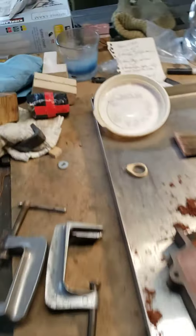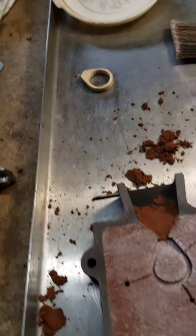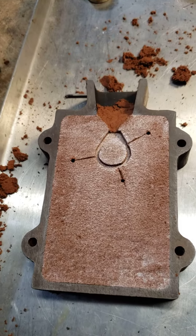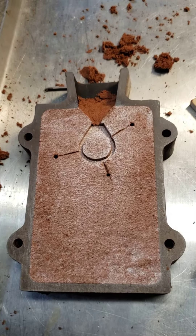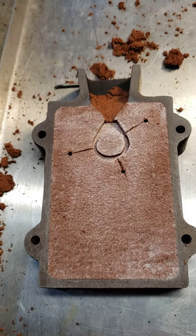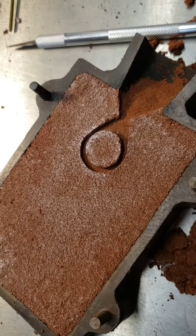Come over here and we look at the positive — is it a stirrup ring? Just finished the flask, cope and drag. That's one half with the vents and the vent holes and the sprue gate. This is the other half with just the sprue gate.